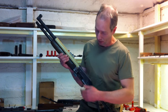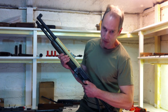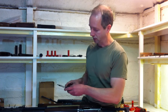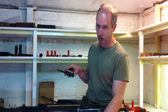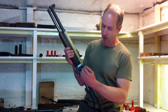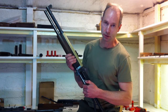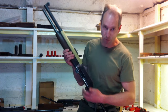So what to do? I had to make the bolt come a little bit back in the bolt open position. So what I did is weld on some material on that surface of the charging handle, and that finally gave me a little bit more than 1 millimeter, 1.2 millimeter more to the rear, and that was enough for the fired shell to clear the ejection port. But there's not much over travel in that system.